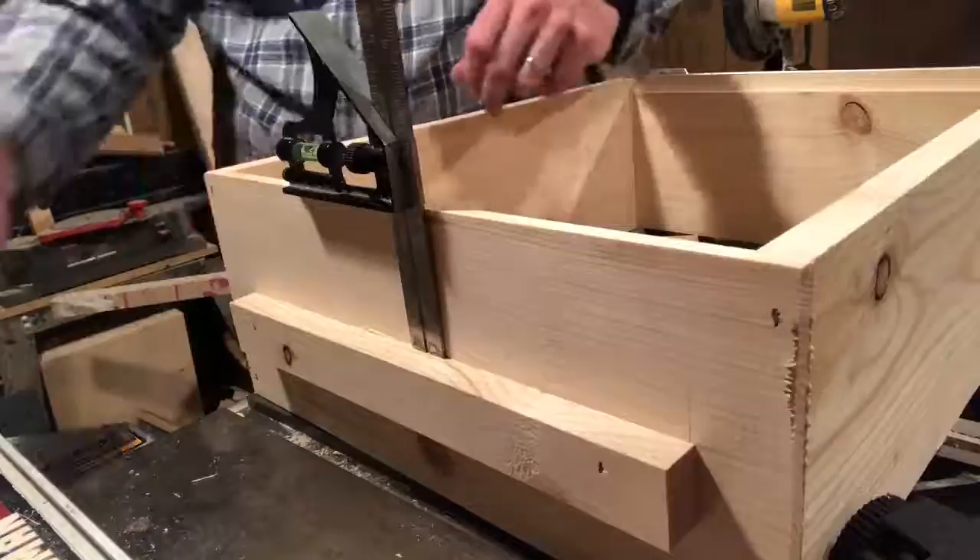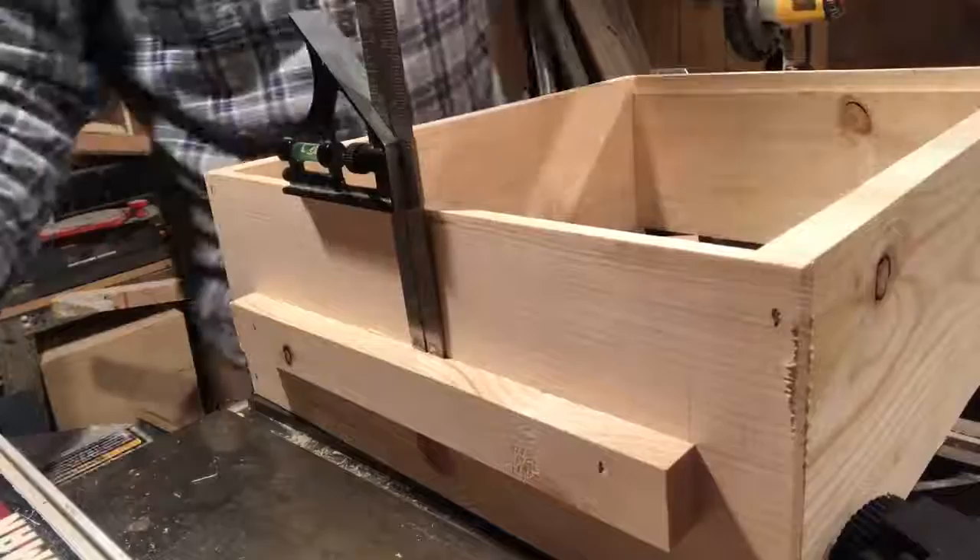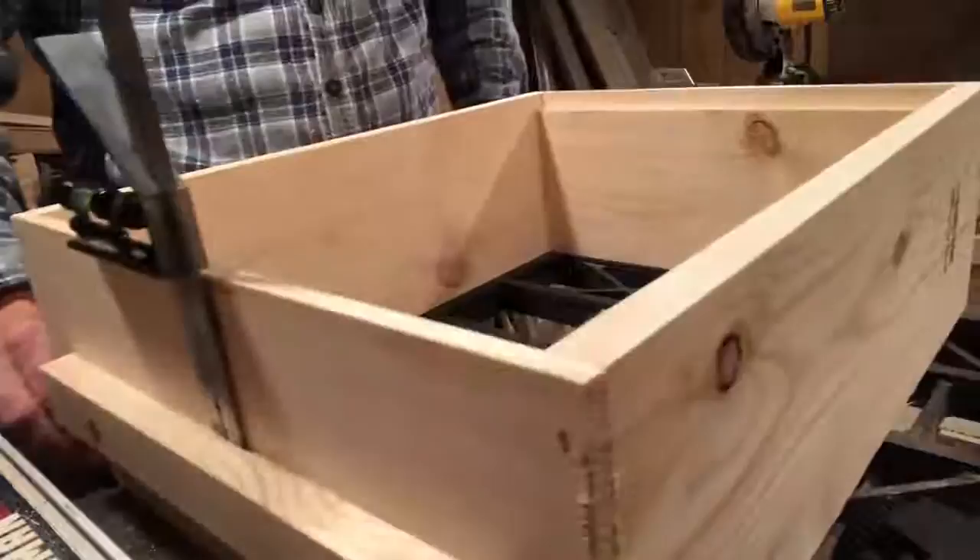Beekeeping is a lot of fun, and making your own beekeeping stuff is a lot of fun. One more thing — I got the cart ahead of the horse here, but I'll show you how I use my table to square the box. Run one edge of your box flush with the edge of the table, and the other edge flush with the adjacent edge of the table, and you have to be square — no messing around.